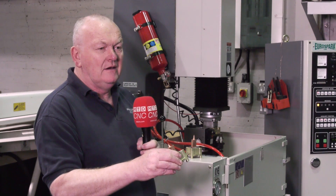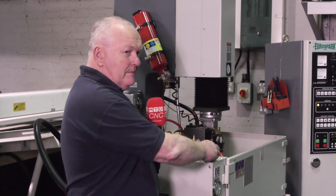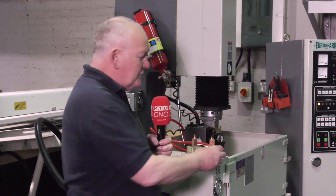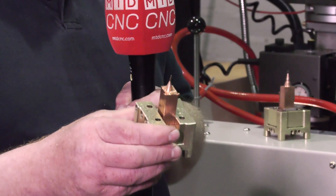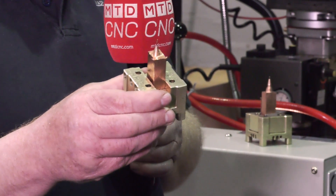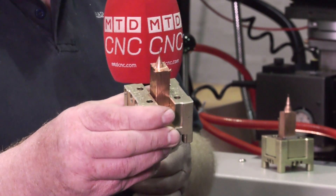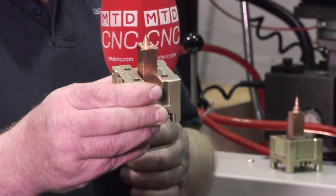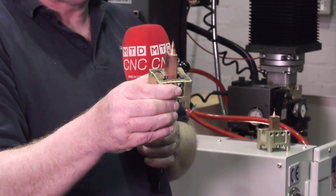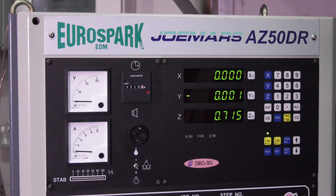Tell me exactly about that example you've just picked up, because the shaping of that is quite unusual. That's the electrode we used to use before to put in the sub-gate — we always have gates of less than a millimeter in diameter. It was very difficult to start that electrode off with the older EDM; it just hadn't got the finesse or the control, and the toolmaker would have to spend quite a bit of time manually working it. Whereas now we use a newer straight conical electrode, and with the fuzzy logic we can pretty much start it off and away it goes.